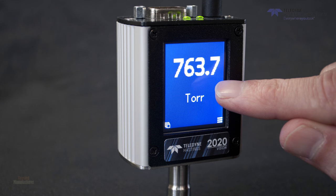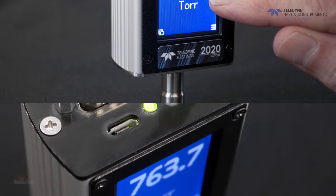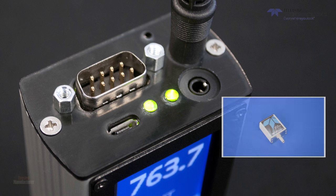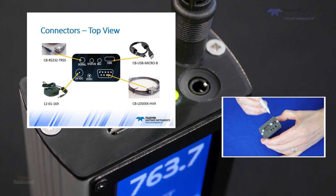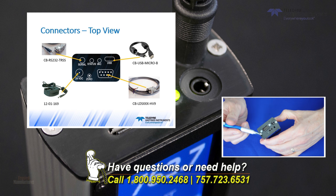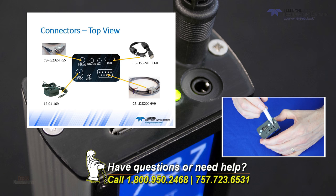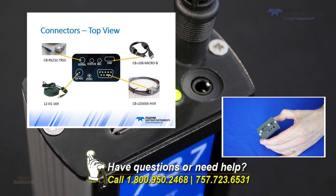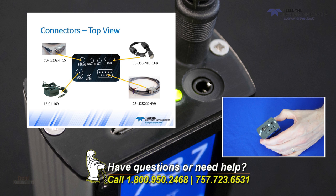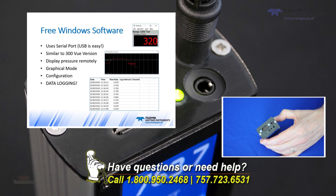The HVG-2020A is very flexible and easy to use. Even without the optional display, the user has access to analog linear signals as well as digital communication. The HVG is easy to power up — you can just use this 24-volt bayonet jack right here. There's also a 9-pin D connector so you have access to the linear analog outputs like 0 to 10 volt, 4 to 20 milliamp, and others. The USB port is available to connect directly to a PC. And there's also a 4-conductor jack which carries RS-232 or RS-485. Once you're connected to one of our serial ports, you can use our free Windows software to see your vacuum readings, view system pump down, and even log data to an Excel file.